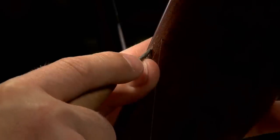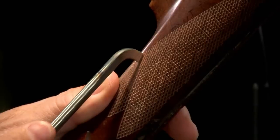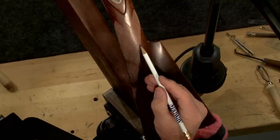In the really tight spots the veining tool works great. After the first pass the diamonds are no longer symmetrical; however, as the crossing lines are cut the diamonds return to their proper shape.